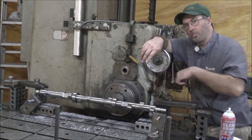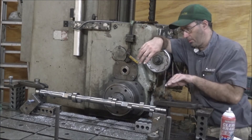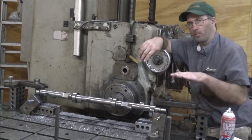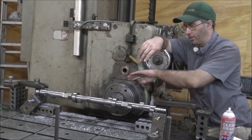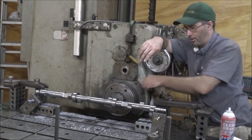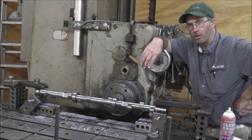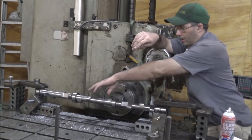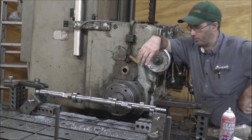In the center, you'll notice that I plunged them with the end mill rather than milling sideways because the cutter force was too much. Without support in the middle, it would just vibrate and ring. I probably could have put some jacks underneath to steady it out, but it was just as easy to plunge cut it and use a few more bits of the end mill that weren't otherwise getting used. It worked well just going in and plunging, and I would do the pairs together at the same level to avoid moving the machine backwards and forwards all the time.